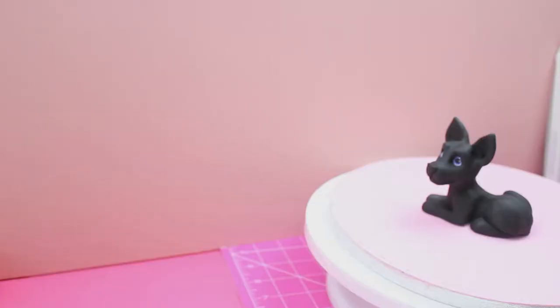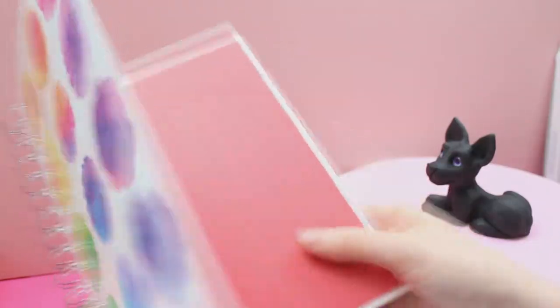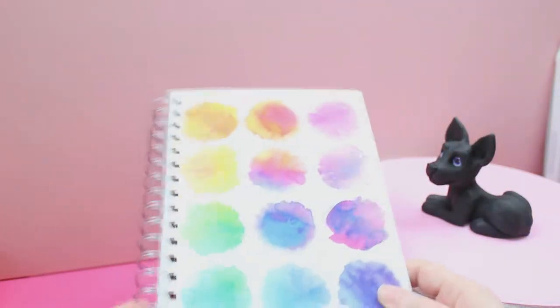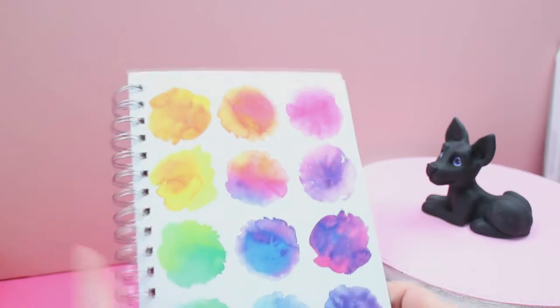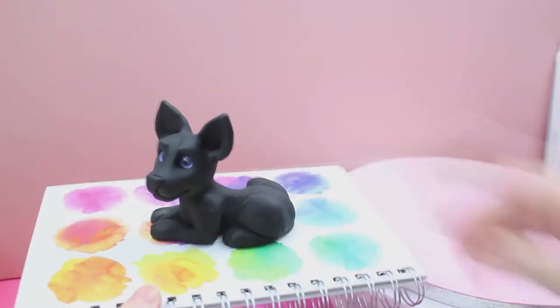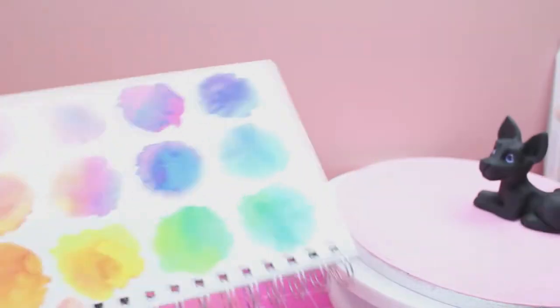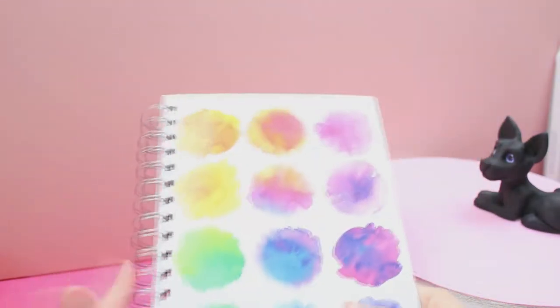Okay, so to start off with, I'm gonna make the mould box, and how I make my mould boxes, I use leftover notebooks, especially ones that have got the hardback. So I've ripped all of the pages out, and then if I take this wire off, I can use this for my armatures, and then literally I'll just put the glue gun on it and then pop four walls round. And that's how I make my mold boxes. Nice, cheap, easy way. And you get free armature wire. How good's that?